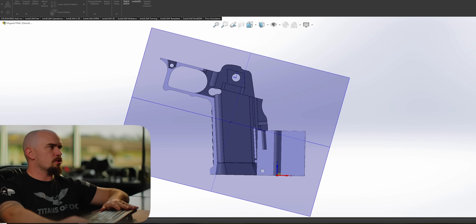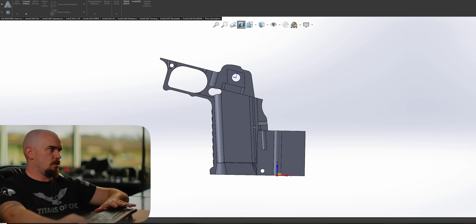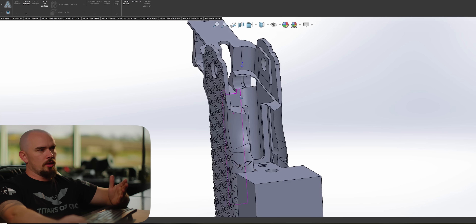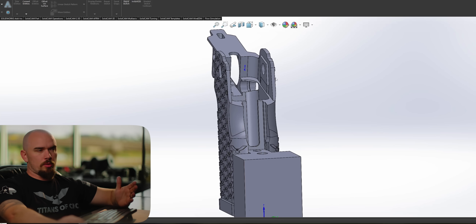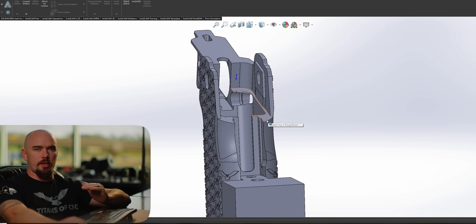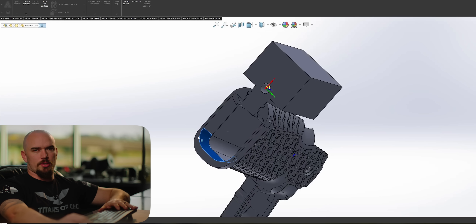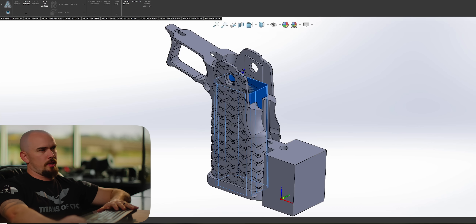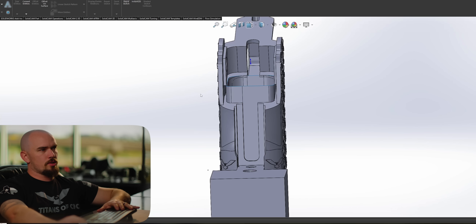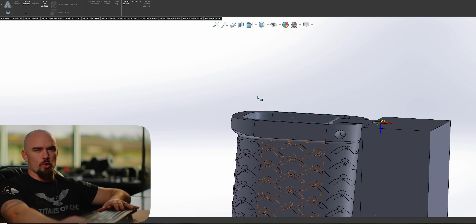While our EDM runs, let me show you how I program the mag well in SolidCAM. In a sectional view, the first thing you'll notice is that the walls of our mag well are actually sitting at an angle, so we're going to use a four-axis toolpath to create this feature. We've also got features going through the faces of our mag well that would make it difficult to use those surfaces to create our toolpath. With the four-axis toolpath we also need to create a top plane and bottom plane for our angle, and those angled surfaces at both top and bottom make it difficult to find a consistent plane.